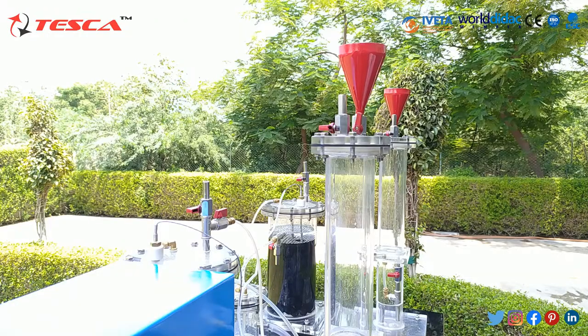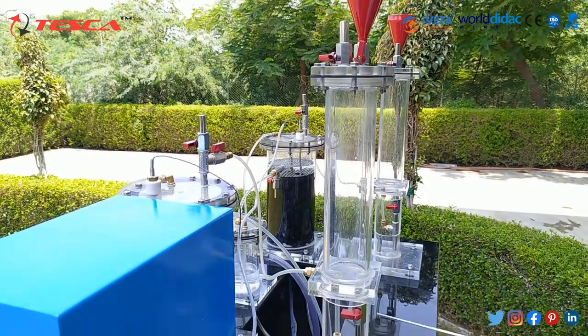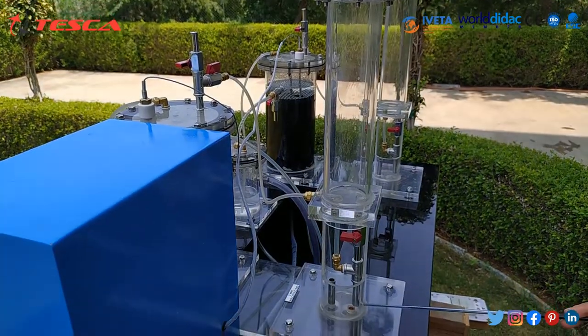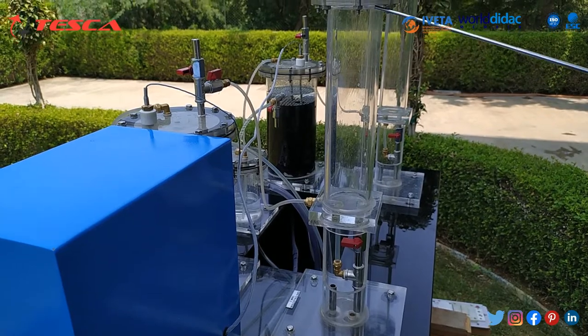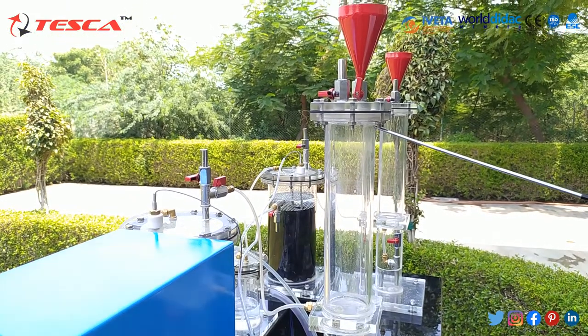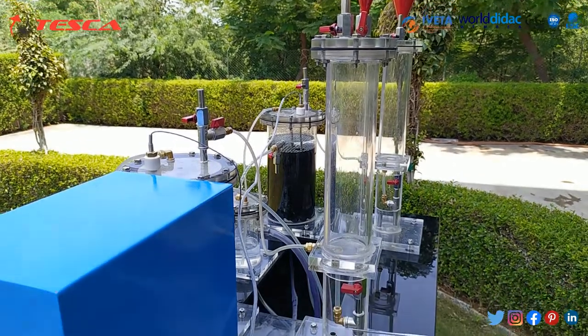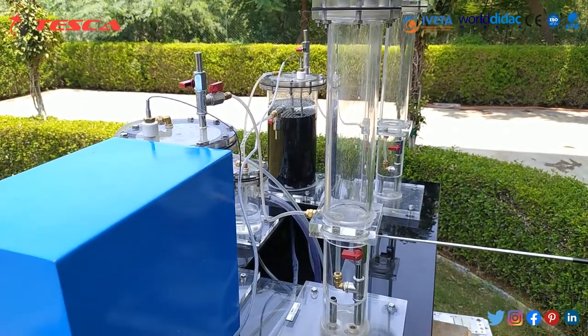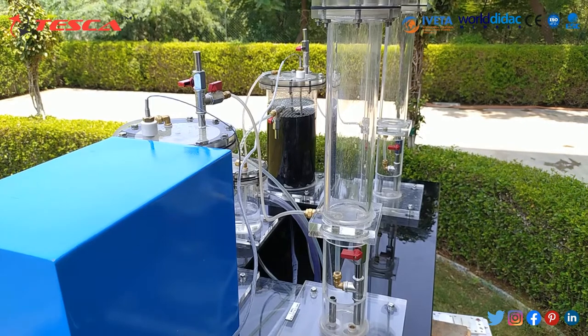Now while column 2 fills, I will explain the gas collection tank 2 mechanism. First, we fill the lower tank with water until this pipe of the gas column is submerged in the water and the drain pipe is out of the water. We then fill the upper tank of the gas collection tank to a mark so that we can measure the gas collected. The gas will come in through this pipe from column 2, and as bubbles of air rise, the water will slowly drain down and flow out from this outlet.